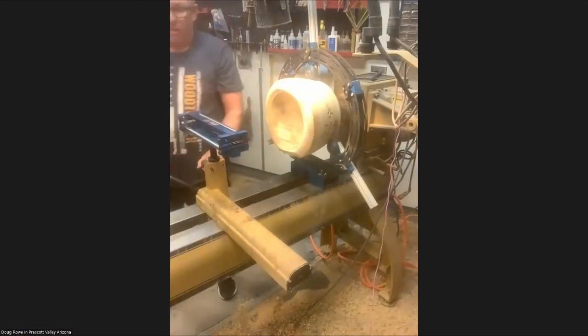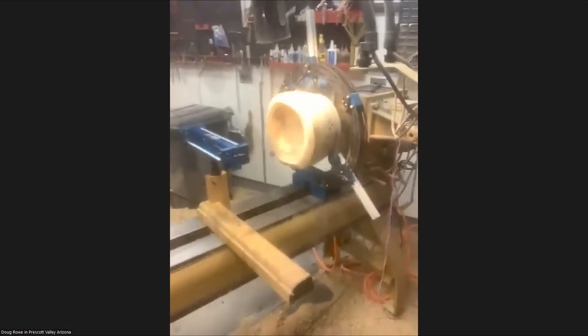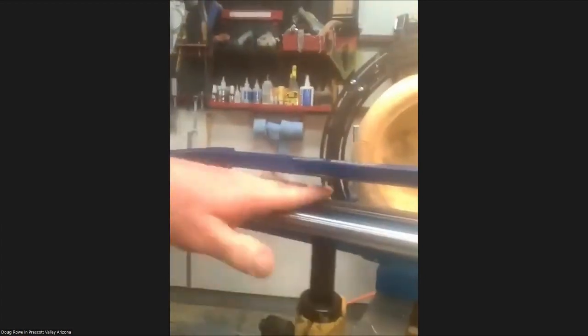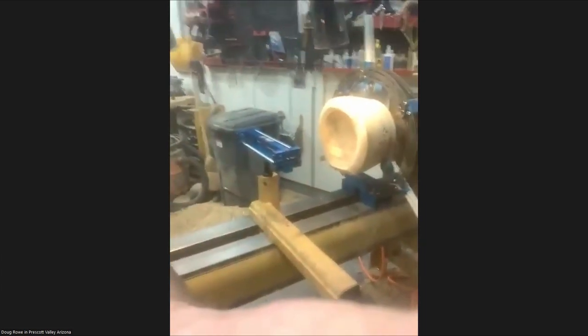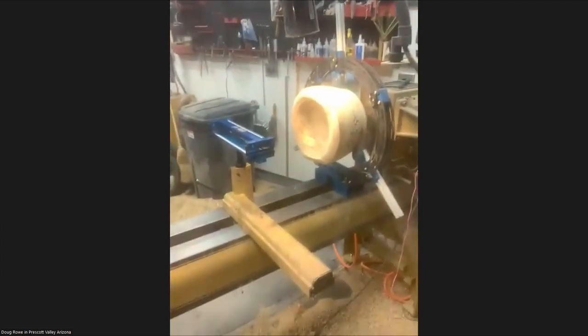One flat side. I'll show that here in just a second. All right. So with this system, I'm going to take you off the tripod here for a second, so it'll be a little shaky. It comes with the holler roller system that you just saw me put in the banjo. And then it has a cool little stop block on there. So you'll set that, you'll play around with your lathe to get it set wherever your center is. There's been times I've had to make little fine adjustments here and there to get it really dialed in. But for the most part, it's there.